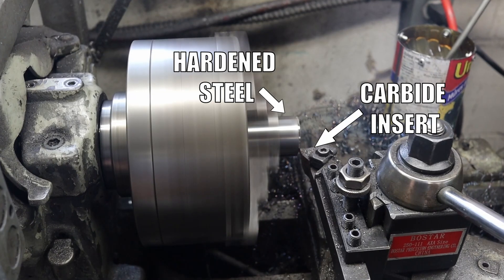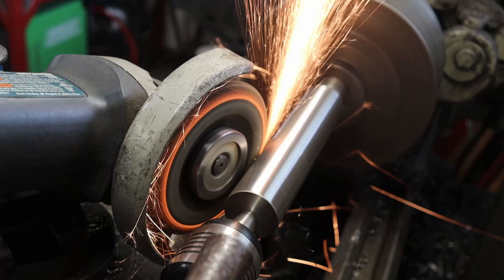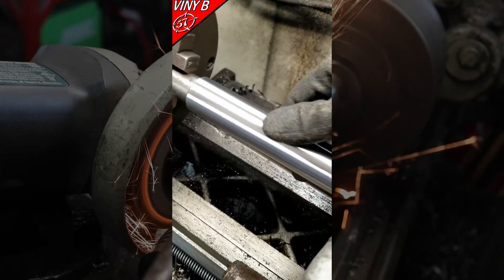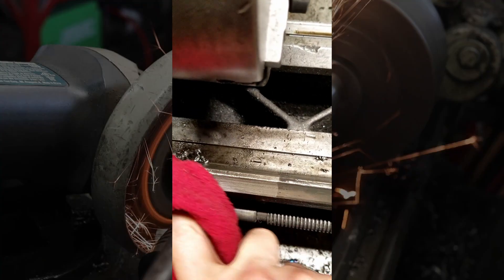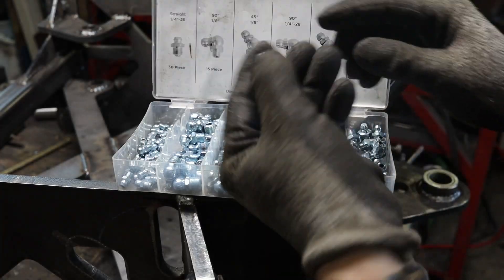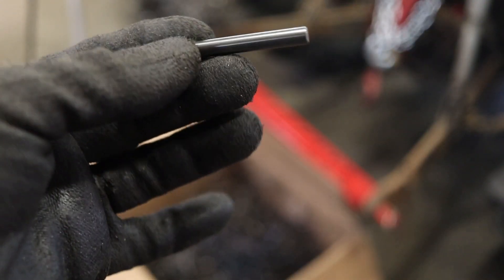After that misfortune, I decided to machine the pins that will pivot in these drill bushings. The steel I had on hand was already hardened, so I fabricated myself a grinding lathe, made a short about it, and boy did I get mean comments on that one. For those who want to know, I bought some ceramic inserts and I'm waiting for them to arrive. You can stop worrying about the ways on the lathe because they're far gone and it's been a while — this whole machine is at its final stage. Once I machined the pins to the right diameter, I added a Zerk to grease the bushings with the pin. That implied messing around with the hardened skin again, and I broke a bunch of end mills.